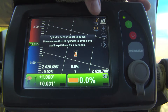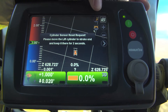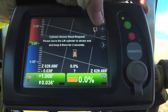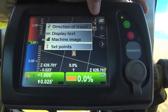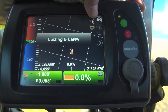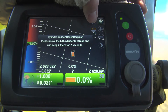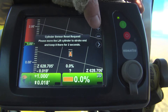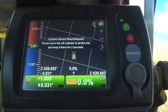One last feature that's really nice with the Komatsu Integrated Machine Control is that if you press this button, it tells you that you're pushing light dirt. Press it again, you're pushing normal dirt. Press it one more time, it's heavy, and one more brings it back to light. If you press this other button, we can change cut and carry — normal, heavy. We can also go to cutting, spreading, or simple grading. Simple grading would be final grade, light material, most accurate.